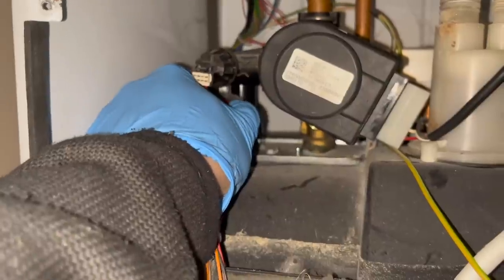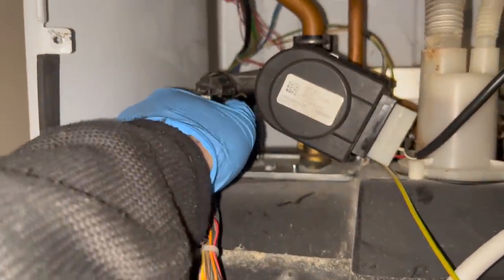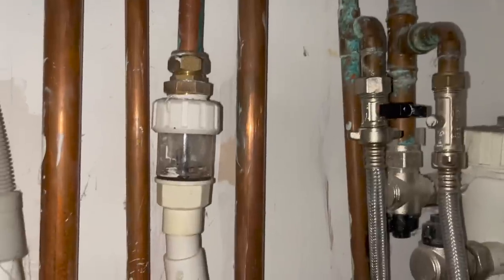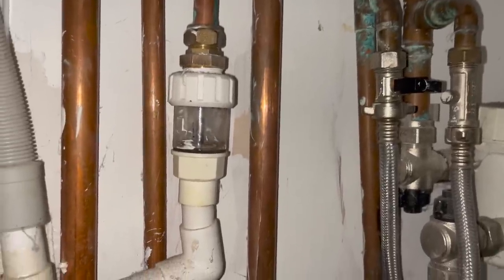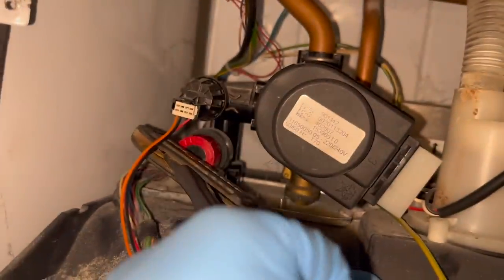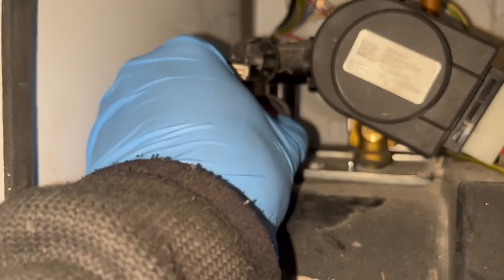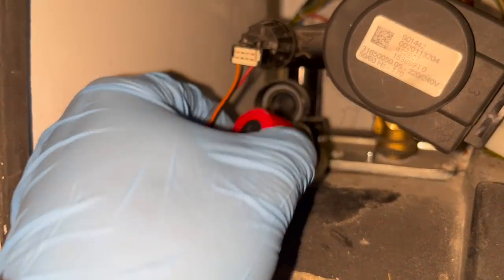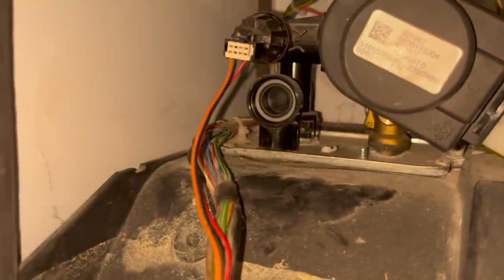The first thing I'm going to do is drain down the boiler using the PRV. This boiler is the highest point of the circuit, so I don't need to bother with isolating the flow and return - just going to drain down the boiler. And then also charge the expansion vessel to push out any water that's in there. I've charged the vessel to just under a bar and the boiler is finished draining. Now I'm going to use some grips and twist out this PRV. Nice thing about this PRV is it's really easy to change - you literally just change the internals, unscrew it out and screw the new one in.